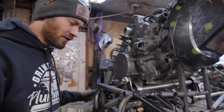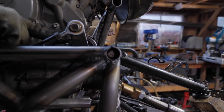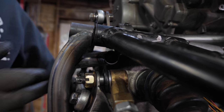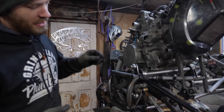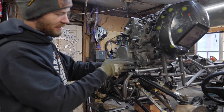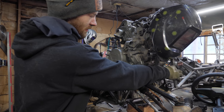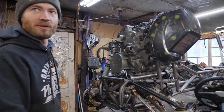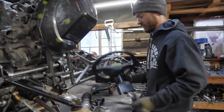I've got this end of the steering looking really good. We've got a solid mount here for both the differential and this steering bearing bracket - they both weld straight to this sleeve, so now that's all one unit. Unbolt this bulkhead and the whole thing comes off with it. To get the shaft out you just loosen the set screws, shove the bearing back, and it comes up and out, then pops out of the rear one. The whole thing is removable, just barely.